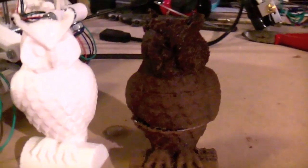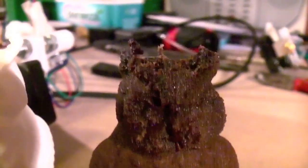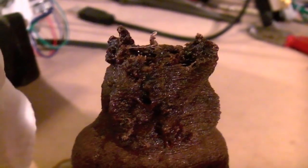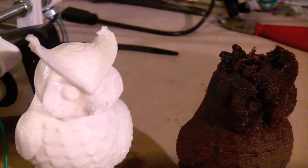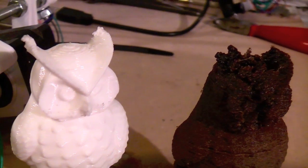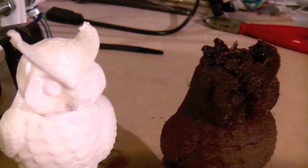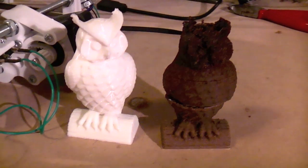The detailing on the outside is pretty good, I think — not quite as detailed as the PLA, but still quite impressive. Although, as you can see, the top up here is a bit messed up. It is on both of them, but more so on the wood. This is because the top layers are really small and the hotend just sort of drags around the molten Laywood. So I think to reduce this, the outside could do with a little bit of cooling — perhaps an extra fan.